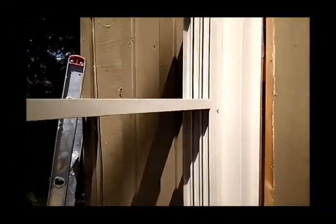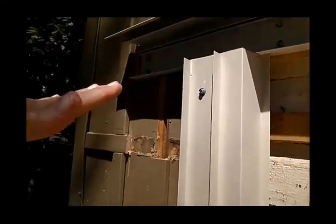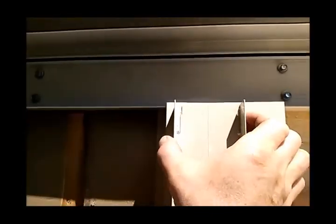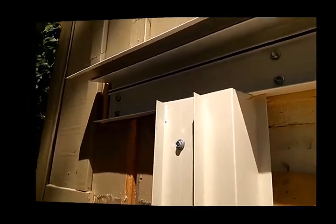We've brought down our beautiful engineered swivel header, and that will adapt to the slope of the roof. Just like that. And the extrusion that covers your wing panel will be coming down like so. A nice trick is to take your grinder and cut reliefs inside the U-channel, then those legs will pinch, and when that panel cap comes on, we'll have an overlap of it to the outside, and we'll have a beautiful clean joint.